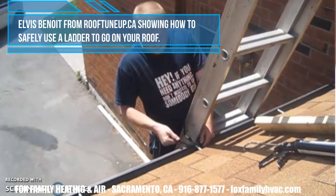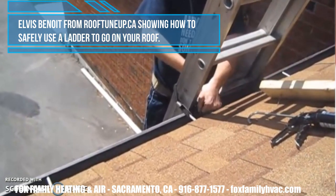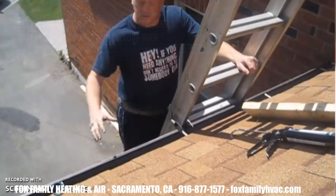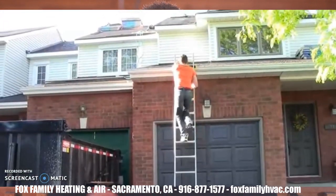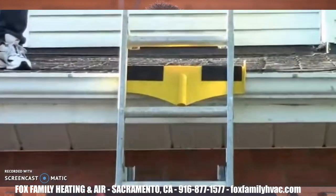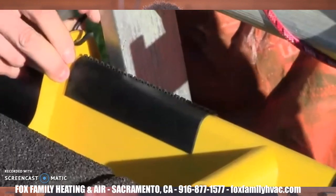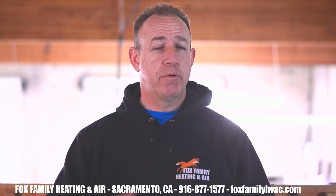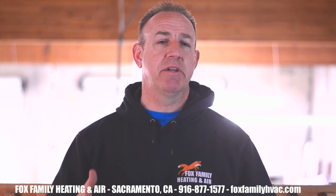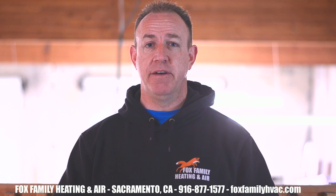This is a culture thing. As the leader on your job, show the rest of your crew how it's supposed to be done. Even as a helper, who says you can't tie the ladder off? You know it's the right thing to do. I bought something for my team called a gutter guard — it props itself inside the gutter, between the outer edge of the gutter and the trim of the roof edge, providing a place for the ladder to rest without damaging the gutter. I've been on jobs before where we thought the lift would go one way, but when the lift operator got there, they decided it had to go another way. Go with the person who has the most experience with the crane and its capabilities. If that's not something that works for you and your team that day, put the lift off until you've discussed it with your supervisor. Then you can go in with a solid plan and everybody will be on the same page.